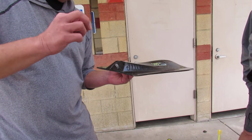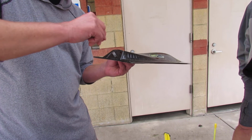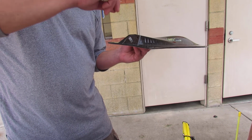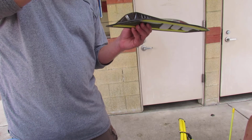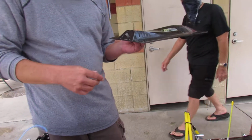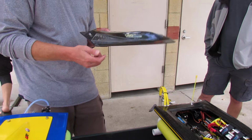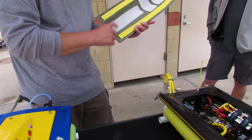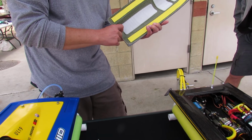I marked my spot and I started turning the drill into the material, and I just kept turning, and all of a sudden it just went right through it with no drill motor, just with my fingers. Just went like diamond. It's synthetic diamond. Yeah, it's called PCD. That's crazy. Polycrystalline diamond. And it doesn't leave any burrs, because that's when you get all the burrs and the hairs from the Kevlar.